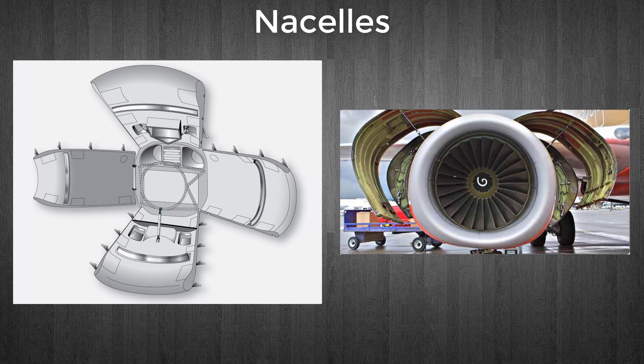Some large reciprocating engines are enclosed by orange peel cowlings which provide excellent access to components inside the nacelle. These cowl panels are attached to the forward firewall by mounts which also serve as hinges for opening the cowl. The lower cowl mounts are secured to the hinge brackets by quick-release pins. The side and top panels are held open by rods and the lower panel is retained in the open position by a spring and a cable. All of the cowling panels are locked in the closed position by over-center steel latches secured by spring-loaded safety catches.